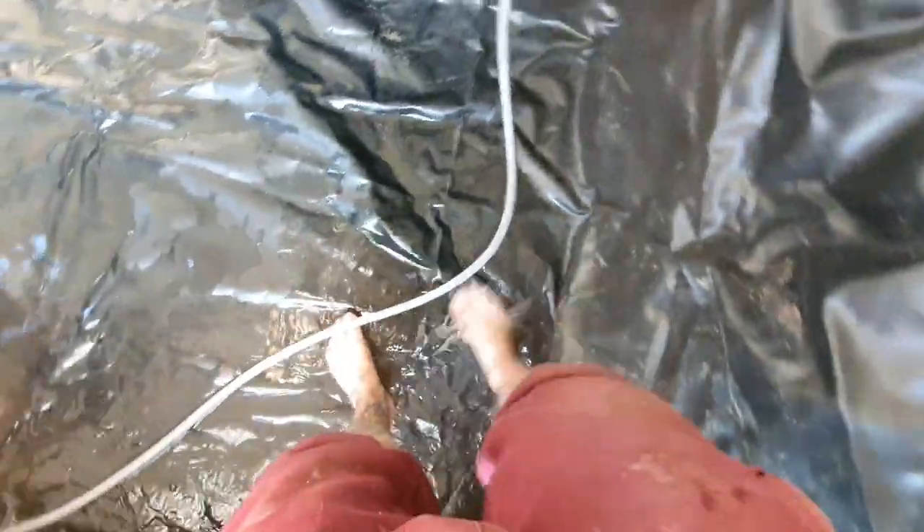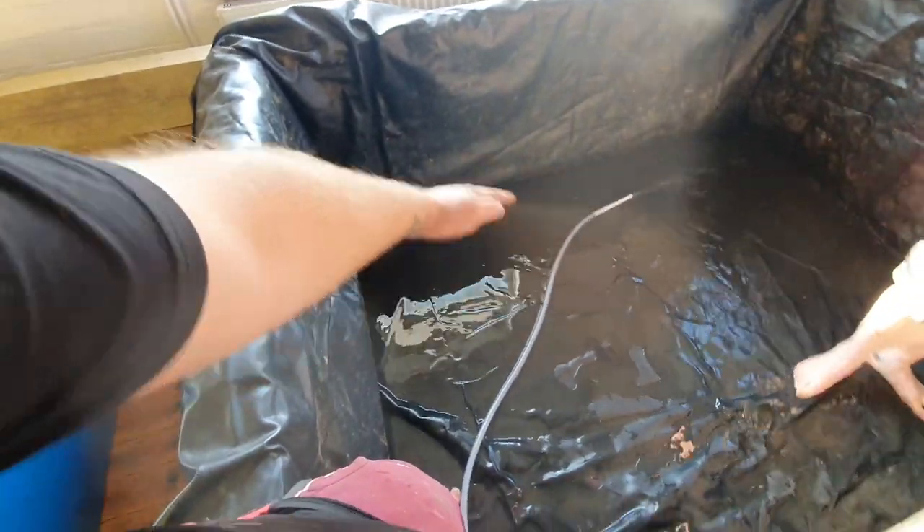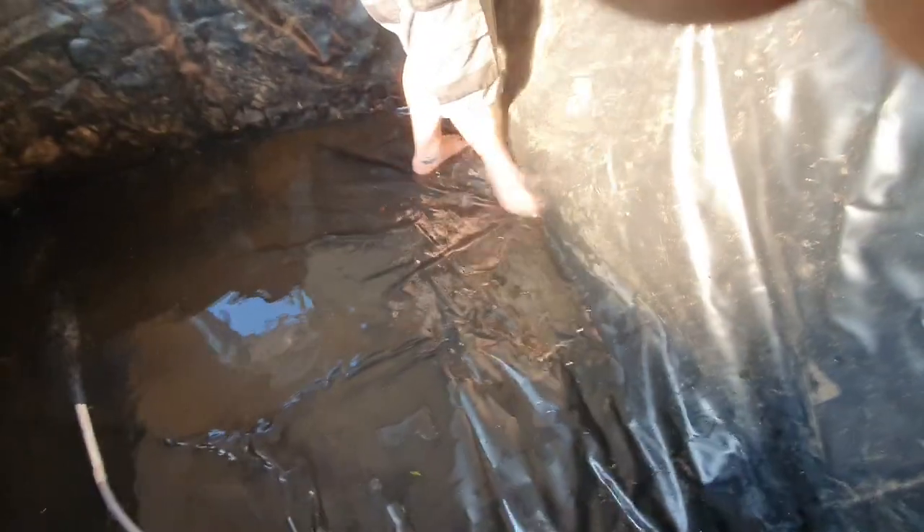When you're taking the creases out of the bottom of your liner, getting in is the easiest way to do it if I'm honest with you. Then start pulling all your creases to one point. My piece of advice is — people are going to be viewing the pond going in this way — so we're actually going to pull the creases all the way to the front.